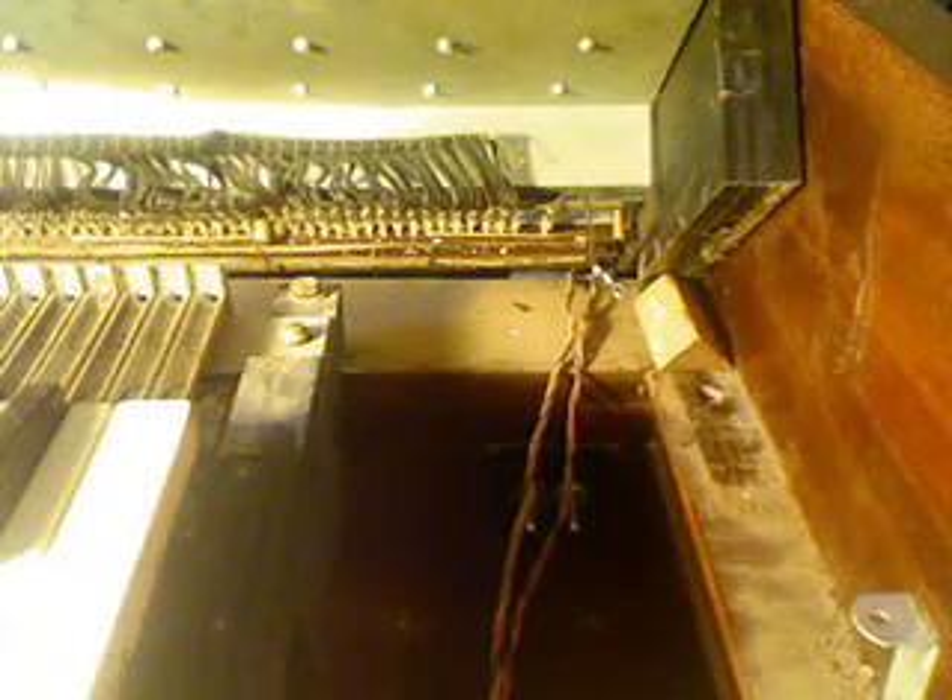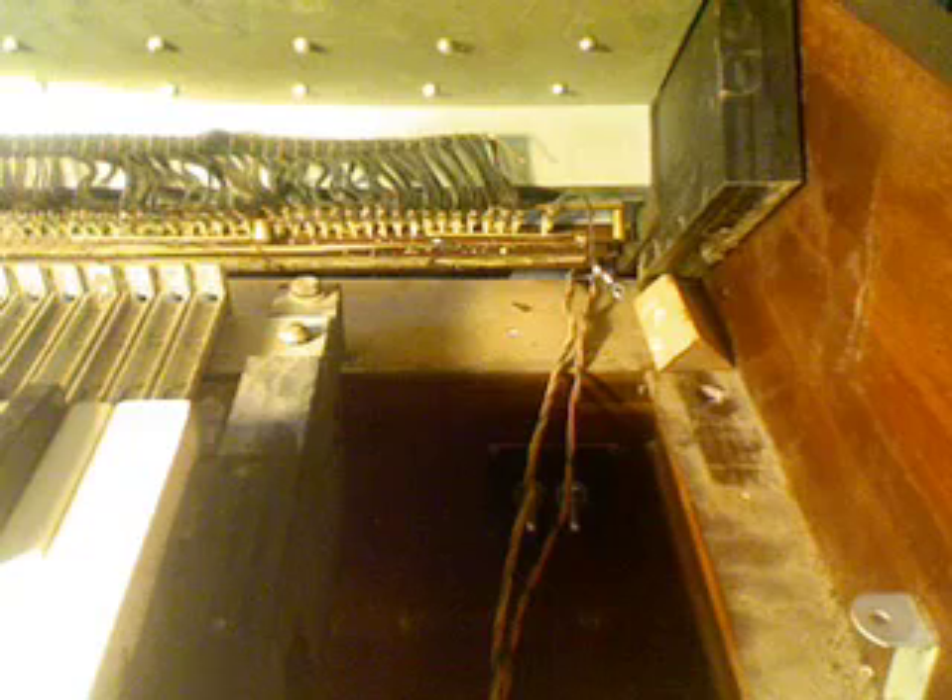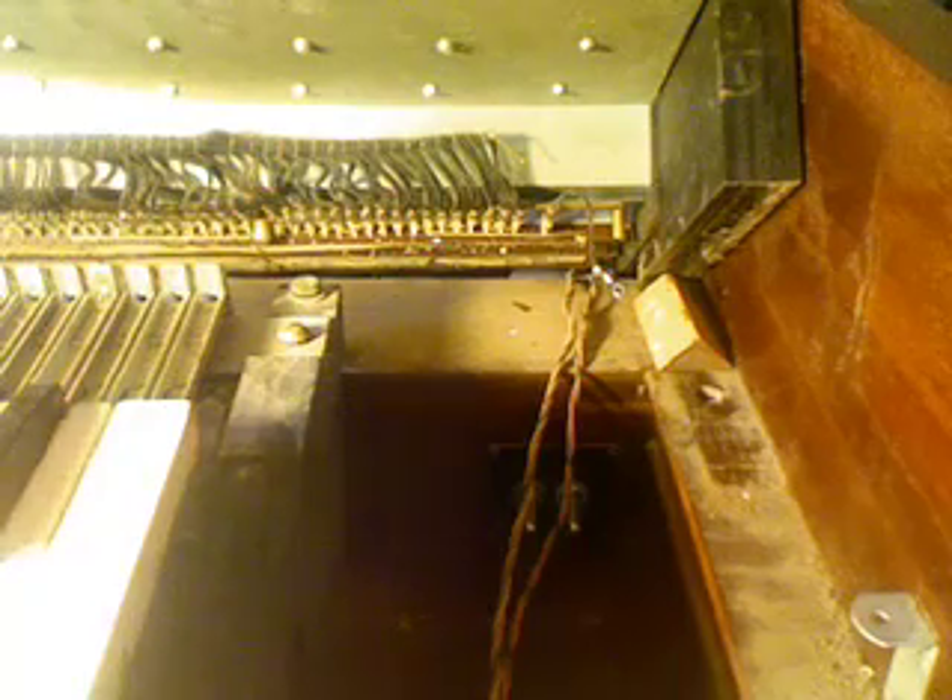At the end here we have one single wire — it's a ground wire. The Hammond percussion circuit leaches off of a drawbar; they always did this with the one foot drawbar. So the one foot drawbar goes all across and there are key contacts for every key because it uses the percussion. For some reason, instead of folding it back, they just grounded them out so there's no tone, but they're still in the circuit for when you activate the percussion.